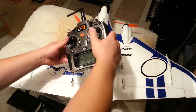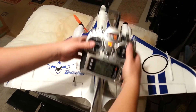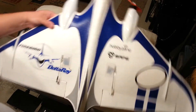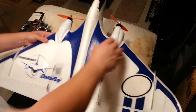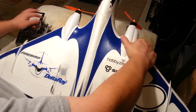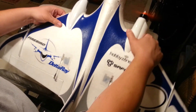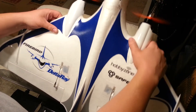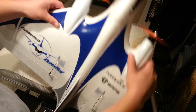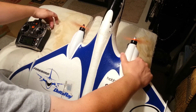Let's do a control surface test real quick. We've got roll, roll, elevator up, elevator down, yaw, yaw — and obviously it's working because the thing wants to take off. The one control axis that's hard to demonstrate is yaw control. We'll give it just a little bit of throttle with the throttle cut on. As this wing dips, it's giving more throttle on my right hand — less as it goes away, more as I pull down hard. It's resisting the yaw impact, which is what you want.